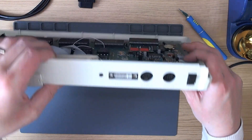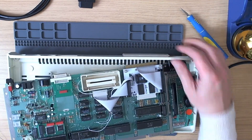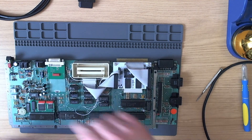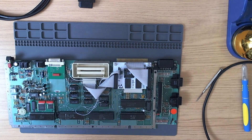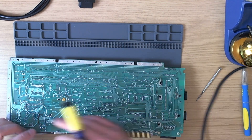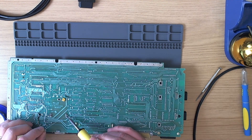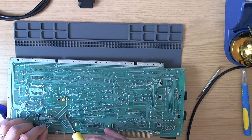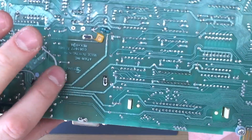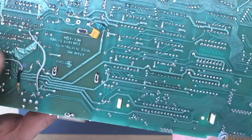I'll ask the owner if he wants the blanking plate, but I think it looks quite nice as it is. The blanking plate is horrible because I make it out of tin can aluminium sheet - it's very flimsy. I used to have some slightly thicker stuff but not anymore, so I have to cut the aperture with a knife and it usually takes about three tries to get it right - it's not fun at all. So if I can avoid doing that I will. I'm not going to absolutely fill these holes with solder - I just want to basically get it connected. I don't want to melt the plastic on the top side.